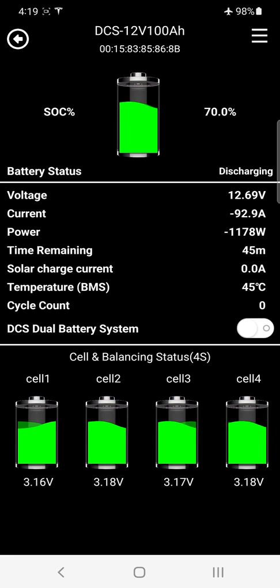Time remaining is computed based on the current load on the battery pack. We run a 2C discharge rate on this marine battery range, so they discharge at 200 amps — enough for a 3000 watt inverter, and most 2000 watt inverters handle induction cookers and similar loads. Reducing the load to 92 amps — one kilowatt of heating — doubles the time remaining to 44 minutes at 69% state of charge.